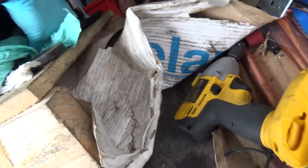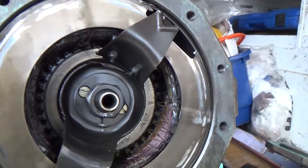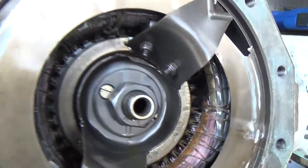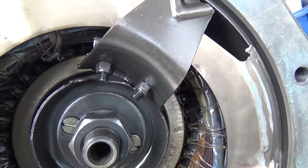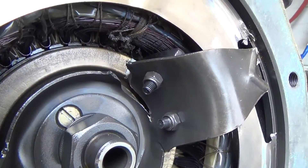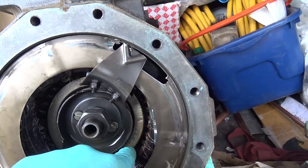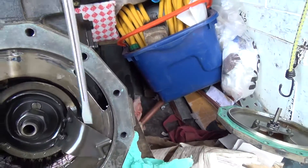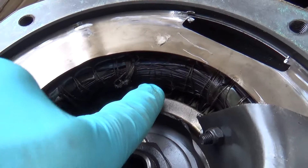I'm trying to soak up some of that oil or I'll be making a mess in the van. That's sheared off, and that looks like it's caught on the windings. This is the counterweight — looks like the counterweight has sheared off. See where it's bright? Unless it's been rubbing on there. Maybe it's been rubbing. I think that's actually what has happened. The counterweight is probably on this, and where it's snapped and bent it's been rubbing on the aluminium of the rotor. Yeah, see that — it's caught on the windings I think.